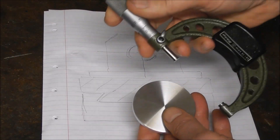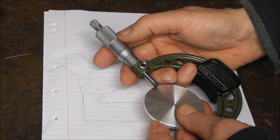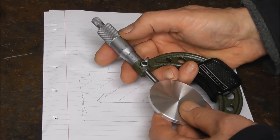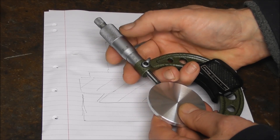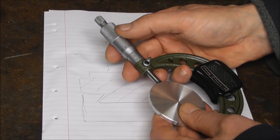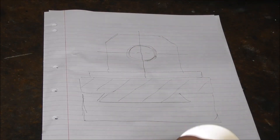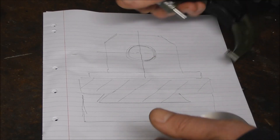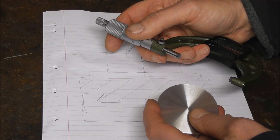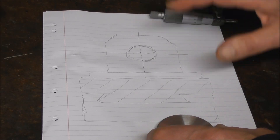I've already talked about how that run of nearly 40 parts on RapidTurn was not as inaccurate as I thought. The theoretical test showed thermal expansion could be as much as three or four hundredths of a millimeter on the radius, but the practical test showed it was plus or minus half a thou — I could machine parts to within two or three hundredths. Not high precision, but alright for general workshop work. Some really good comments posted under part 20 were helpful, and I did some study and thinking to try and summarize why it was so much better than anticipated.